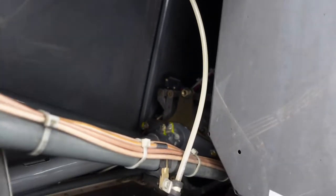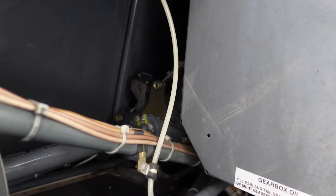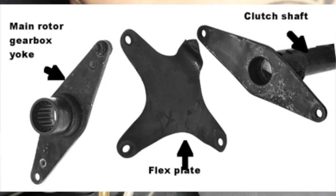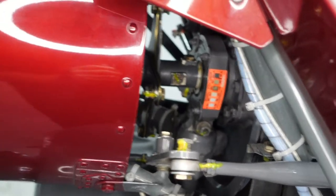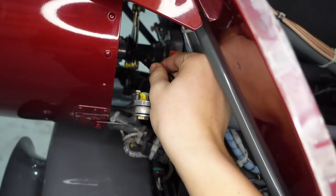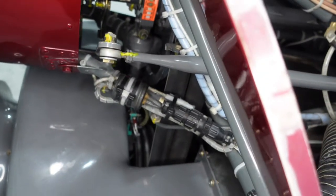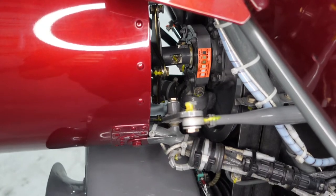The next thing we're checking is the rotor brake. I go and actuate it with my arm and you'll see it move up and down — that's how we make sure the rotor brake is working. Then the flex coupling and yoke flange. The flex coupling is the gold part, the yoke flange is the gray part, with the flex plate in the middle and the yoke flanges on the two sides. This allows the driveshaft to flex and move up and down so there's no pressure on that long driveshaft. We actually have three of them — here's the second one.